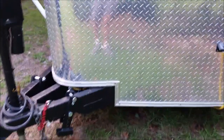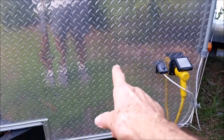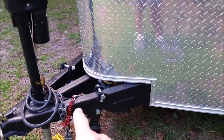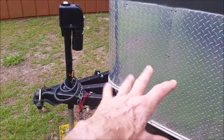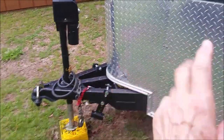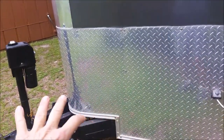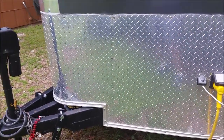The breaker panel that's on the inside, underneath the counter, on the other side of this wall right here, used to be bolted right to that beam right there. It was weatherproof and it sat right there, and all the circuits went everywhere from right here. I put it on the inside, on the other side of that wall, fed from right there, and re-routed all the branch circuits into the new location.